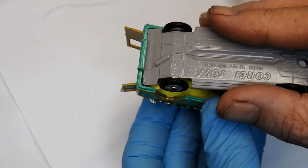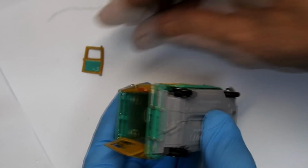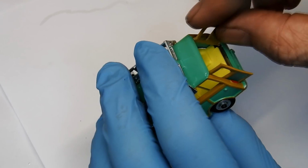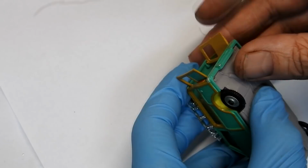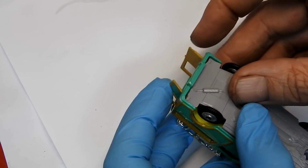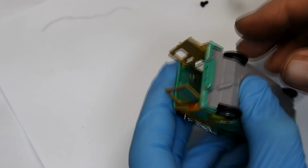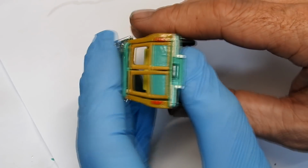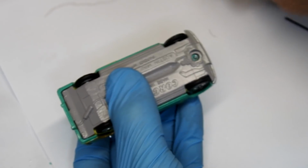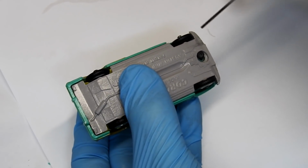They're too small to push into the top and bottom notches designed to hold them in place. You can actually get them to stay in there, and they do just kind of work once the base has been screwed tightly on. I've drilled and tapped the post there, and I'm using a little 2-56 button head screw to hold it all together.